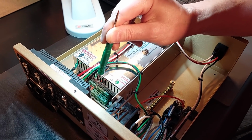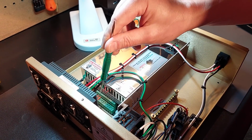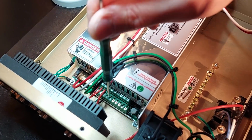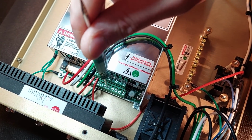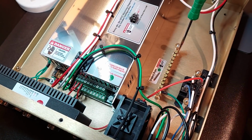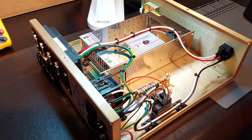What you see here is a custom design power supply. What you don't see inside of it is it has a built-in EMI filter as well. So with these amount of terminals, you can hook up whatever accessory you'd like to expand this system to, and he won't have to install the required terminal splitter in order to give him the proper amount of power outputs without splitting or daisy chaining terminals together. This keeps everything, once again, really neat. If we look at the chassis, this is a 12 by 12 enclosure. You can see how clean this is.